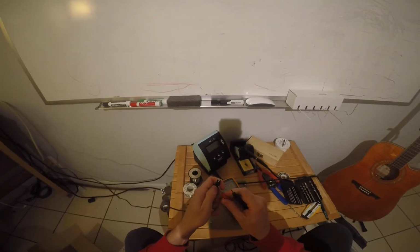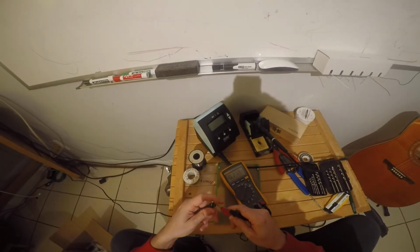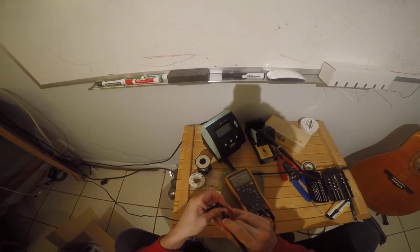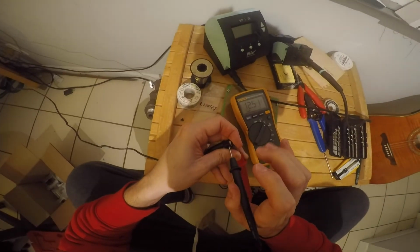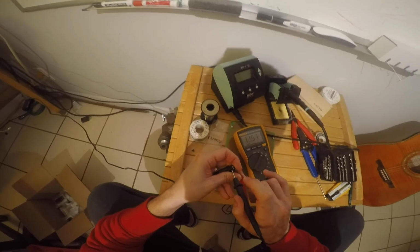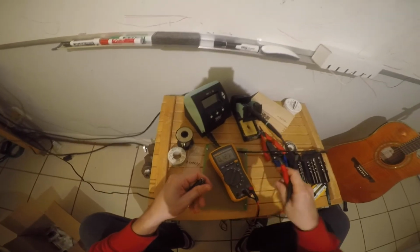Okay, and I'll just connect my pins like so, and it looks like I got the terminals reversed. So it looks as if the back terminal here is going to be the positive, right? This guy toward the back, if you can see it, that I've connected my red one to, is positive. The one toward my front is negative. And this third one on the side doesn't do anything. Okay, perfect. So 12 volts on back, ground on front.